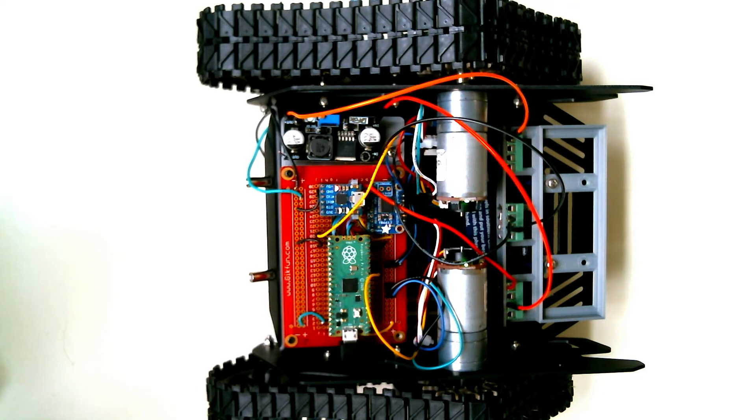I cleaned up some of the connectors - crimped up some better connectors. I've got the colors all reasonably correct now, with the same colors for each motor going to the right places. I'm not sure whether I've got the left and right motors aligned with the right plugs, but I can change that as I go. This should get most of the base done, so I can close it up and put the Raspberry Pi on top and start trying to drive it around. But first I just want to try out the motors to make sure the tracks turn in the right direction.